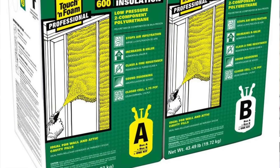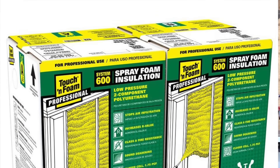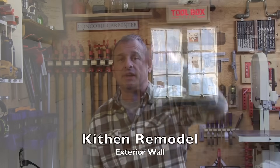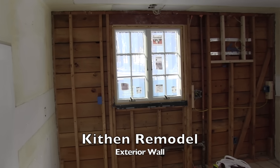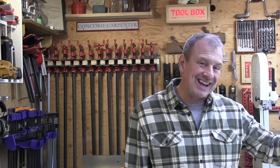In these situations I purchase a foam spray foam pack, a froth pack, like DAP's Touch and Foam Pro System 600. On small remodels, like a bathroom, I might only have one exterior wall to deal with, or a wall and a ceiling. Hiring that spray foam contractor doesn't always work in the schedule.